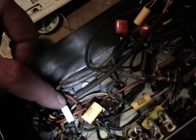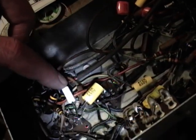I remounted the can capacitor and then restored the wiring as it was originally. I also now have the proper capacitor in here. If you recall, that was supposed to be a .005, but at the time I only had a .004 on hand. Well, the correct value is in there now.